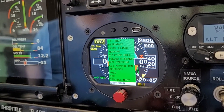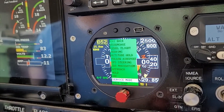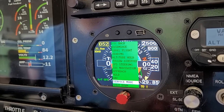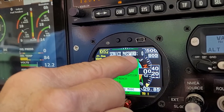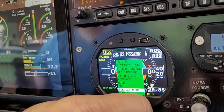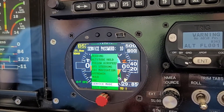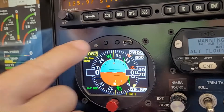Today we're going to be talking about service mode. These modes are hidden so that not everyone can change your parameters. When you select service mode, you get a service mode password input and you rotate the knob. The service mode password is 10, which gives you all the parameters you need to adjust the autopilot. You enter 10 and then press the left button.